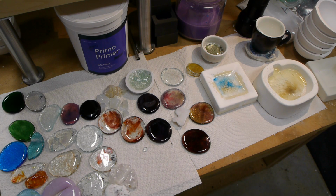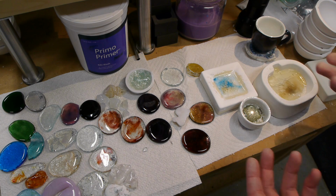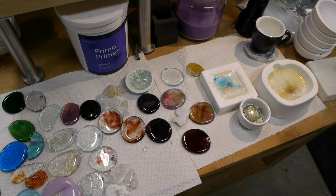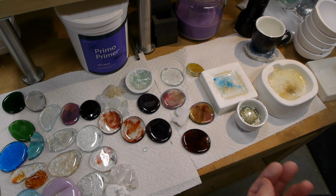Also, I should point out that you might have heard of float glass. So commercially, if you want to make a big sheet of glass and make sure that it's really flat, what can you do? You don't want to put it through rollers because the rollers might mar the surface, or you'd have to adjust them to make them really parallel. So the way that glass is made commercially is a giant vat of molten tin, and they pour the molten glass on top of the molten tin, and because gravity makes things flat at the small scale here, you're guaranteed that everything will be flat and uniform because you're dealing with liquids. It's like the surface of a lake, right? It's going to be flat.